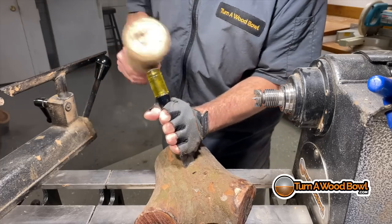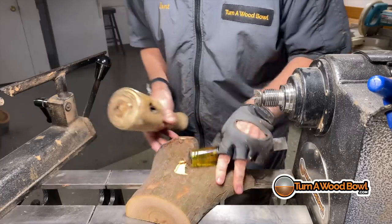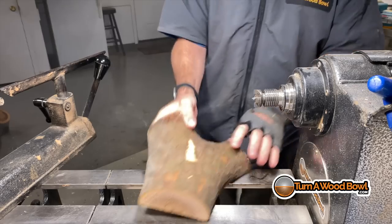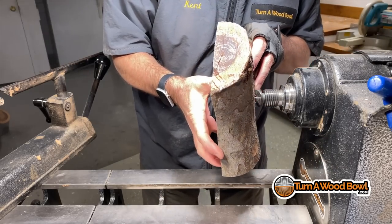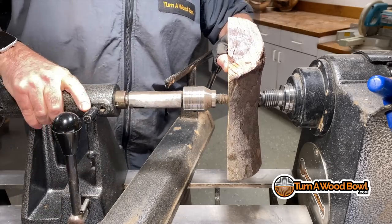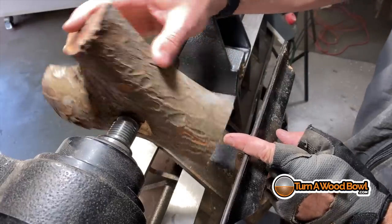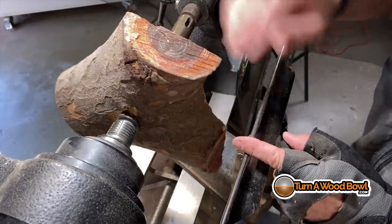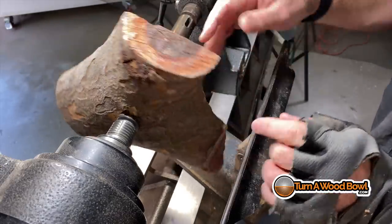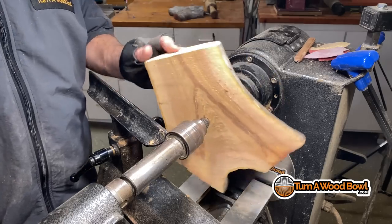I need to know exactly where to center it so I don't run off one of the sides accidentally. I'm going to use the four-spur drive center, but when I put it up there it wasn't seated flat. So I'll take a chisel and chisel out a flat area that I can mount to the lathe for a good secure connection. With that flat area created, I can go ahead and mount it. The biggest thing with a live edge bowl is making sure the top edges are balanced. I'm using the drive spur so I can take my time and balance these out — just holding my finger in place, loosening the tail stock and making adjustments until everything is well balanced.